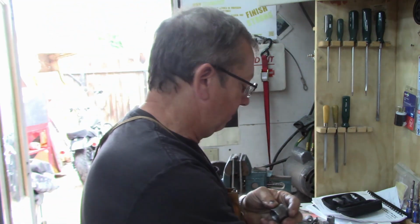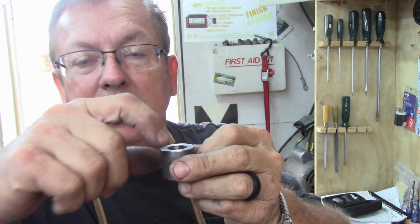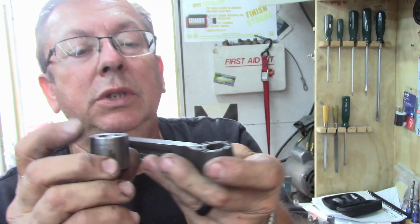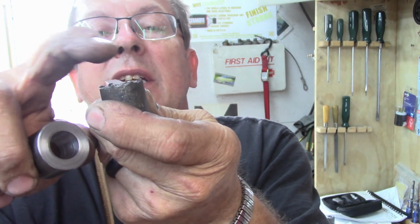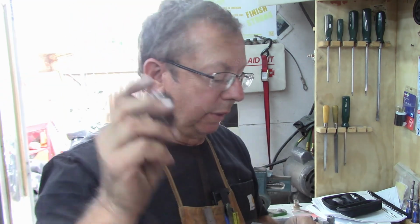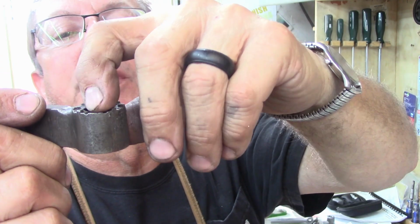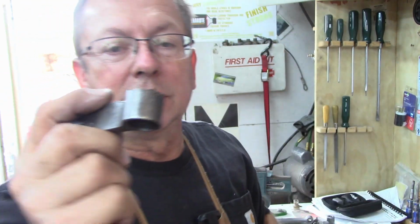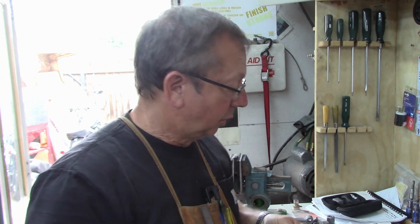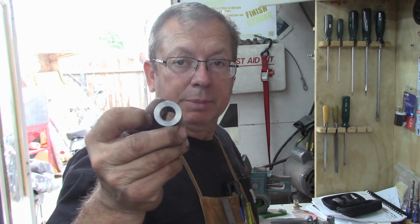This will go into the index head on the milling machine, and I'm just going to go ahead and cut my little quarter inch grooves in the top of that. This one you can see there, they extend up, and there's four different directions. Anyway, it's got the adjustment all the way around, and they've left these little nubbins up. Now this one's got some that are squished down over the years. This has just gotten beat up, and there again, this was the way I got this tool, so it works fine. But anyway, we're going to set that up in the mill and do that.